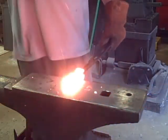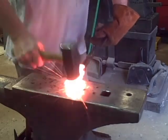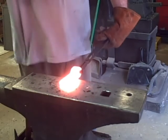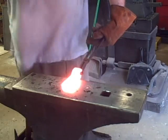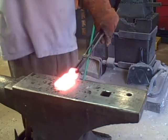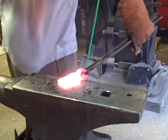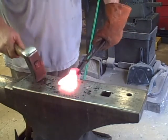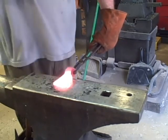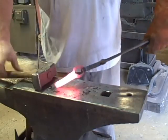Next is to work on the blade part. What you see me holding onto with that pickup tongs is the eye. This is about a four-pound hammer with a peen that's about three-quarters of an inch with a good radius on it, and I'm moving that steel. I'm beating on something that's nine sixteenths of an inch thick, and that's a lot of steel to move. You have to be sure that this is heated all the way through to lemon yellow, close to white. If you don't, you're not going to move it effectively. You can see I've already pushed that end down to about half.